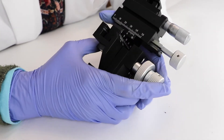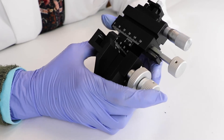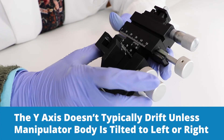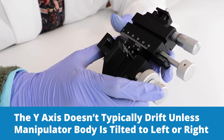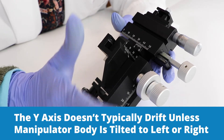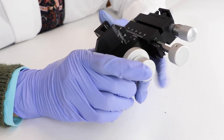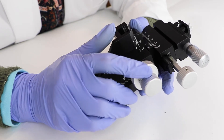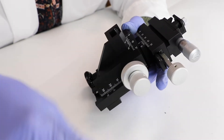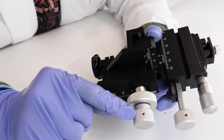The manipulator operated in a standard position with the electrode clamp located above the manipulator body means the y-axis doesn't typically have a tendency to drift unless the manipulator body is tilted to the left or the right relative to the vertical plane. The y-axis tension is adjusted with essentially the same technique described for the x-axis, using the screw on the y-axis.